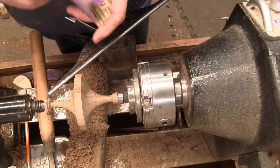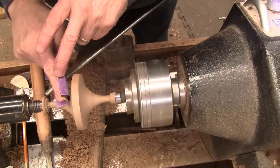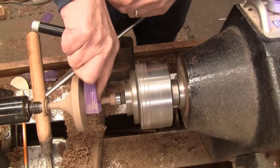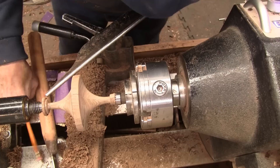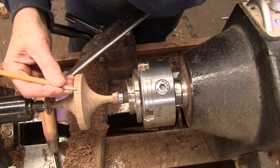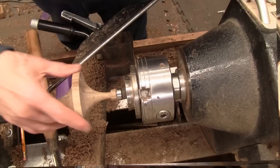It's getting late. I'm going to do a little sanding with 150 grit — I'll do it in reverse — just a light sanding to expose the grain. What I haven't done is knock these corners over and I want to think about that overnight. I don't know if I want a full radius or just to round the corners over. We'll do that tomorrow.